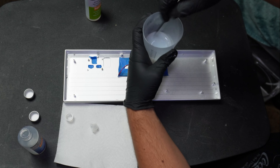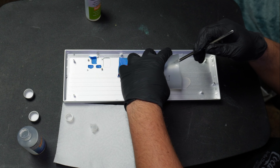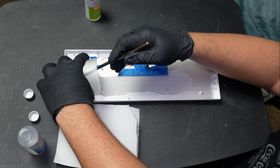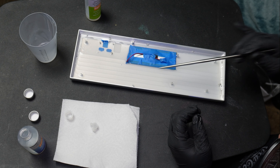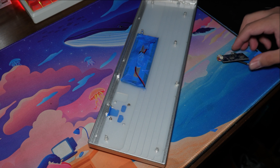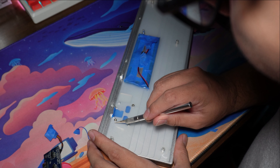Part A, Part B, one-to-one mixture. Now there was a worry I originally had about pouring silicone around the battery. I didn't submerge the battery, so the bottom and top of it is still clear, and the bottom of the board is aluminum, so heat dissipation hopefully plays off of that. I'll just monitor temperatures as I use it over time. Now we're going to cut out the crevice for the USB-C controller — did a rough estimation of where it sat, cut it out, and pulled it out.